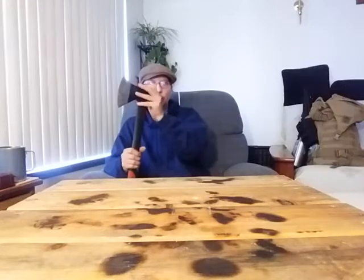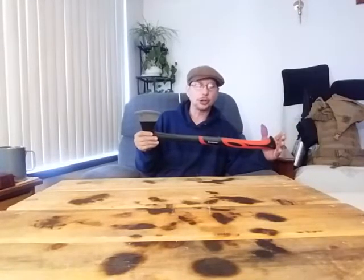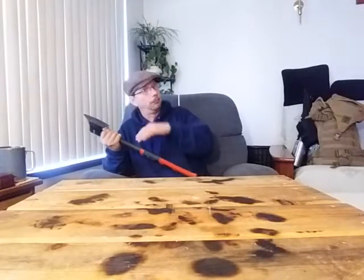Because of the way the plastic wraps over and they adhere it through pressure and heat to the axe head, you're not going to be able to fashion something that works long term out of it. But with a handle that comes through the head, even though it won't be nice and ergonomic unless you have wood skills, you can always get a nice good hardwood branch, form it and fit it up in there, hammer it in real good, put a wedge in it, and you'll be good to go. It'll work for a good amount of time, and when the handle breaks you can just make another one.